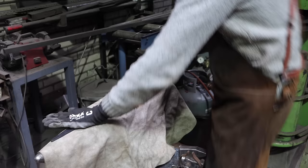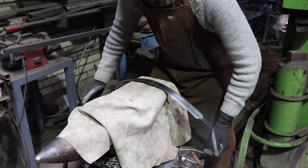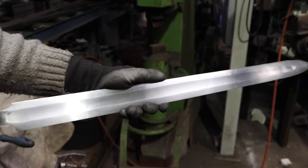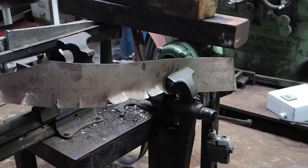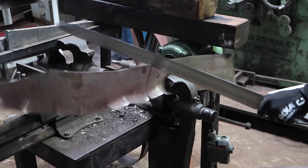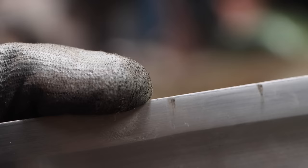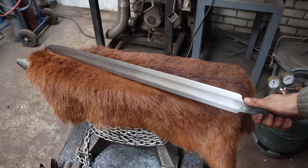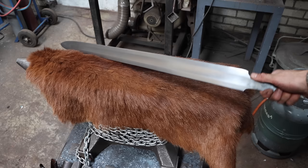The sword is very flexible. This has to do with the profile, but also with the crucible steel. In fact, it's one of its qualities. The blade can cut steel with some minor surface smudging. One can imagine what a blade like this would do on the early medieval battlefields. Most swords were not even hardened in those days. When hit very hard, an inferior sword would be badly damaged or even cut in half.